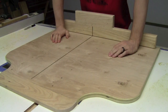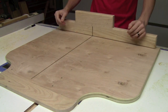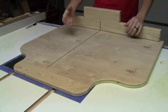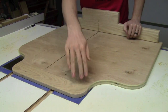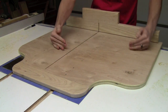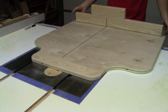First off, one of the main things that people have been asking me is how come I did not put a fence on the front like I did the back? Because most sleds typically are a pass-through construction, which means they can start anywhere back here and be able to pass through the blade. Well, this one is a little bit limited in that respect because I don't have a fence that rides over the blade. And to be honest, most sleds that have the fence on the back typically are about this wide, maybe sometimes a little wider, but I felt that I didn't need something to overhang this far on the back of the table saw